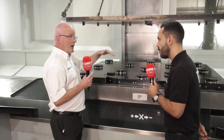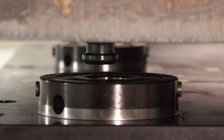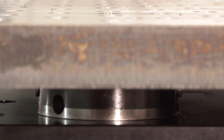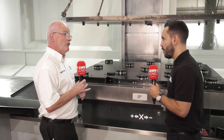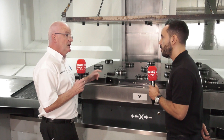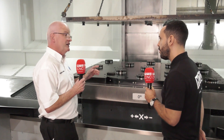Three jaws pull out and then the plate can be taken out. To repeat that process, to put it back in, just drop the plate in, take the air off, and they spring to clamp — so setup time is reduced to almost seconds. They're currently doing a similar operation on another machine over there but without the zero point system, and that's taking about an hour to take off and put back on again, whereas with this it'd be a matter of minutes.